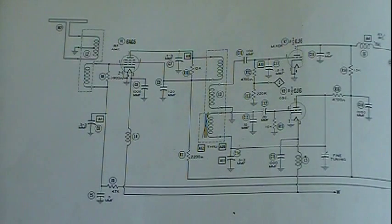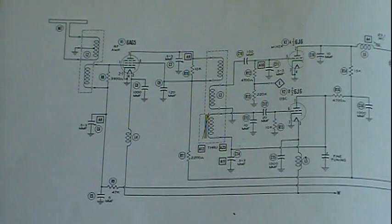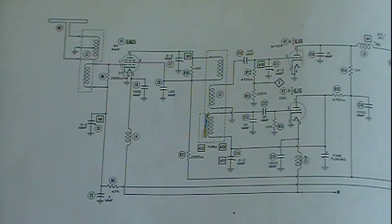Those radios were expensive, but your average homeowner, consumer radio had one or two. But the whole purpose of the IF is the fact that I have one single frequency, no matter where I tune the dial, I have one frequency that I can do my master main amplification with. That way I can design my amplifiers so that they are efficient at that one frequency and that one frequency only. And that way I can get the maximum gain I can ever get out of a particular IF tube that I put in there for an amplifier.